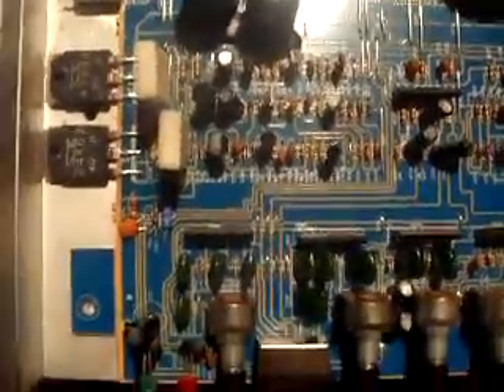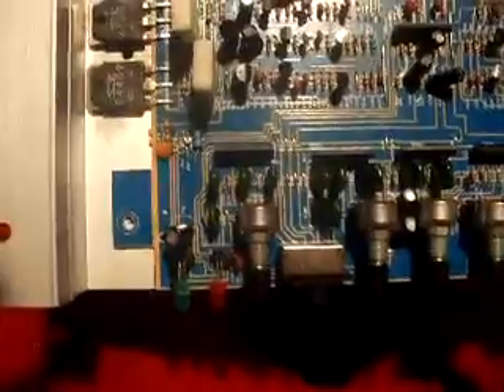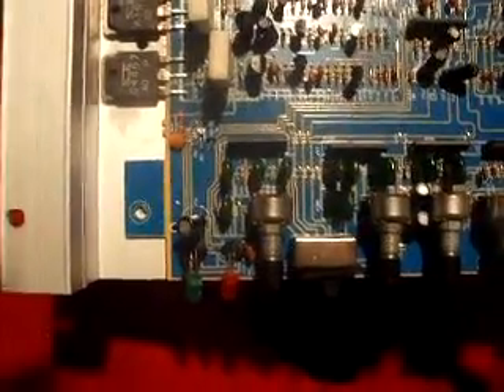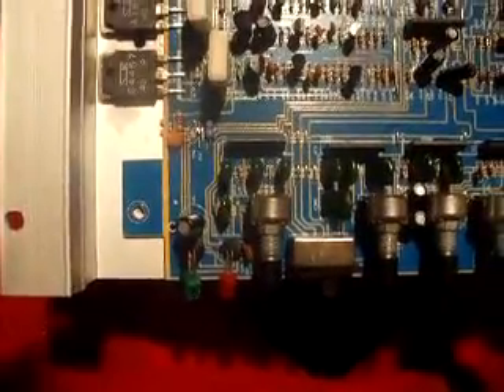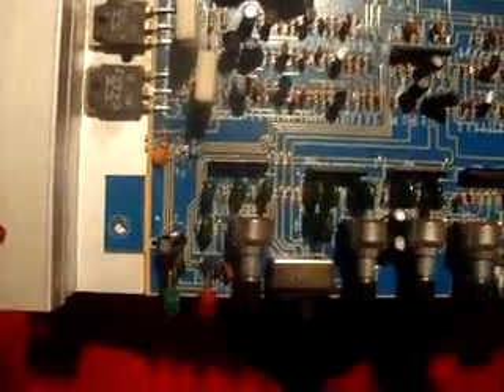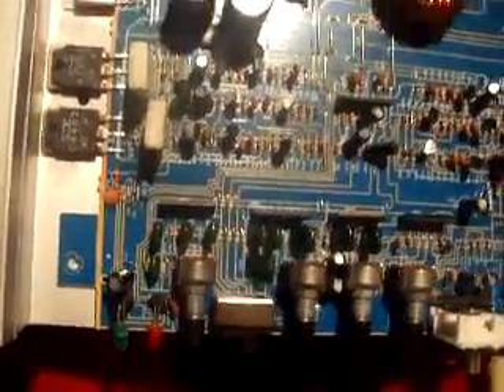Hopefully you can see these are the SK — higher, they're 80-watt ones. I also looked up the specs; most of the specs are give or take a couple — these are a little higher — but the collector and the emitter were pretty much the same. So let's go ahead and hook her up. I gotta grease these and whatnot, but again, this is a cheap amp that was given to me, blown.